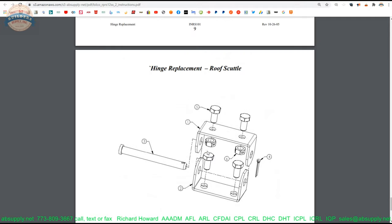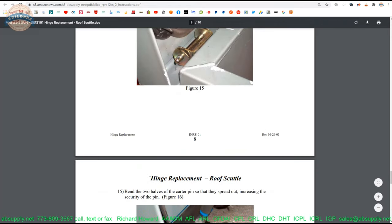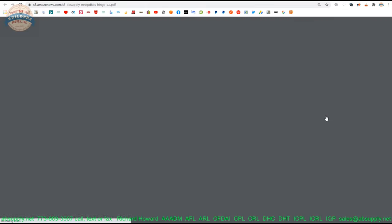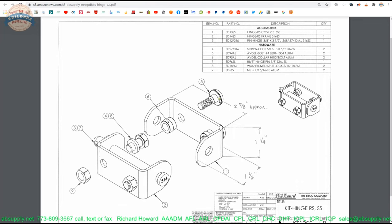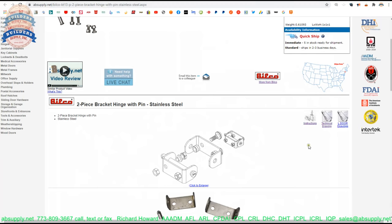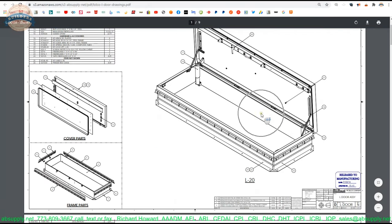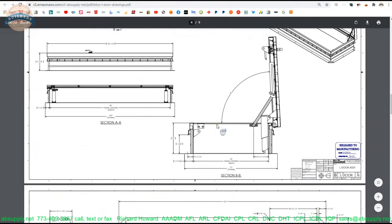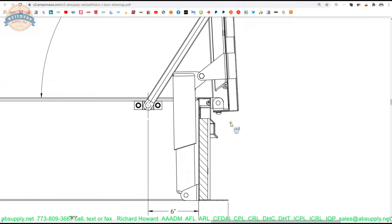So you will know the difference. If you have an aluminum roof hatch, you are going to want to use the stainless steel version because those units are meant to be basically as non-ferrous as possible. But if you have just a steel lid, then you will want the gold zinc dichromate hinge set. We can also look at the technical drawing, which is handy — it is going to allow you to review what it is going to look like and what parts are available, with dimensional properties drawn in. Then we have the L series door drawings, which refer to the hinges. The quantity necessary is going to be based on the size of your unit. They do show the smaller of the two being the sidewall version — the sidewall is where you are going to install that. Obviously they have been engineered to be installed in that fashion.